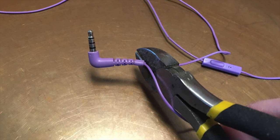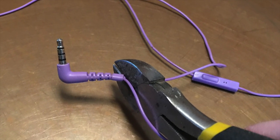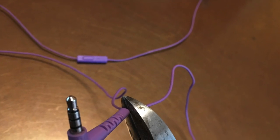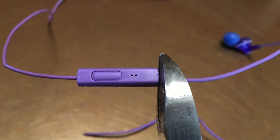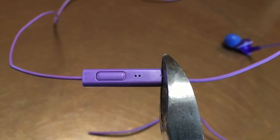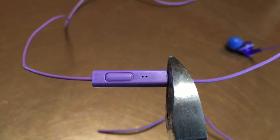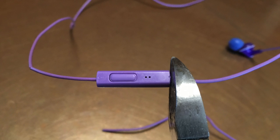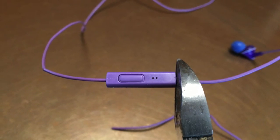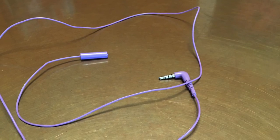Do not cut here — yes, that's me just about to snip off the side of the microphone. Good thing I paused to take a picture, or else I'd have wasted my $10. Oops, cut the other wire. That leaves you with a headphone jack hooked up to one wire that has both a microphone and one earbud. We need to get rid of that earbud since we're not using it. Place your wire cutters just above the microphone and snip. It's safe to make these two cuts — the microphone doesn't share any wires with either of the earbuds, so all we're doing is snipping away wires we're not going to use.